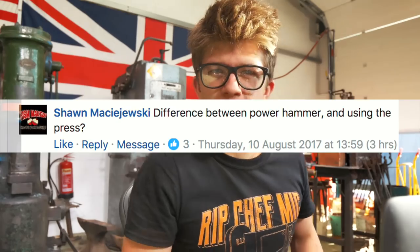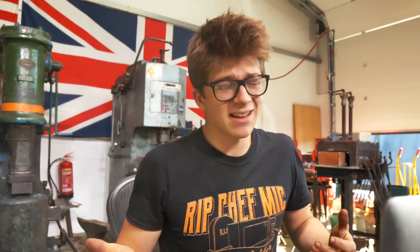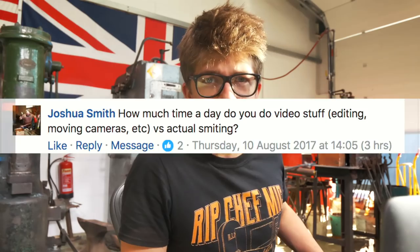Difference between using the power hammer and using the press. Power hammer hits, press squeezes. The reason I use the power hammer more is that press is extremely fast, which means being able to finely control how you're moving the metal is a little bit more difficult. It has a speed control on it, but still I'm just a hell of a lot more used to using a power hammer. For my style of forging and the way my brain likes to work out blacksmithing operations, a power hammer works out a little bit easier for me.